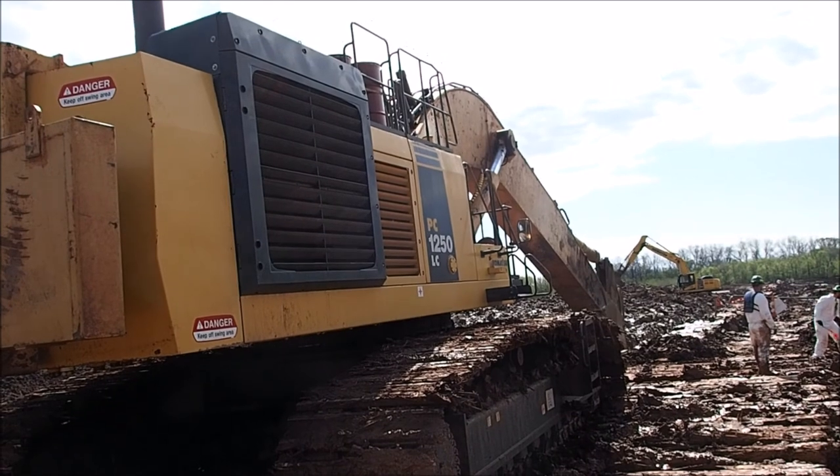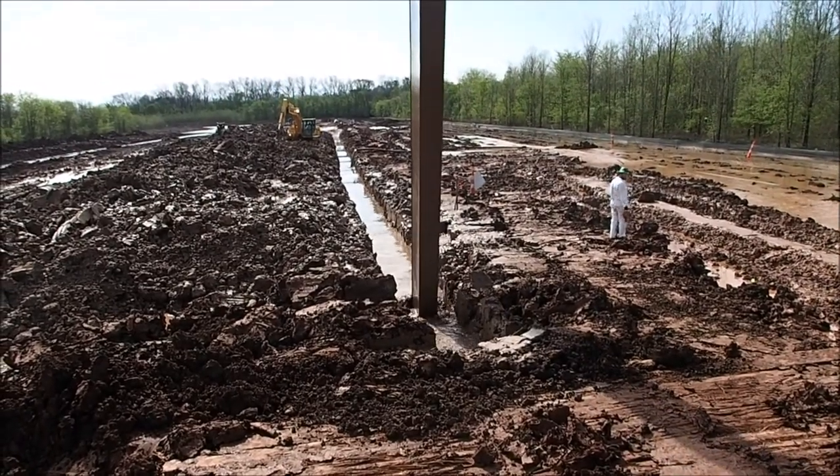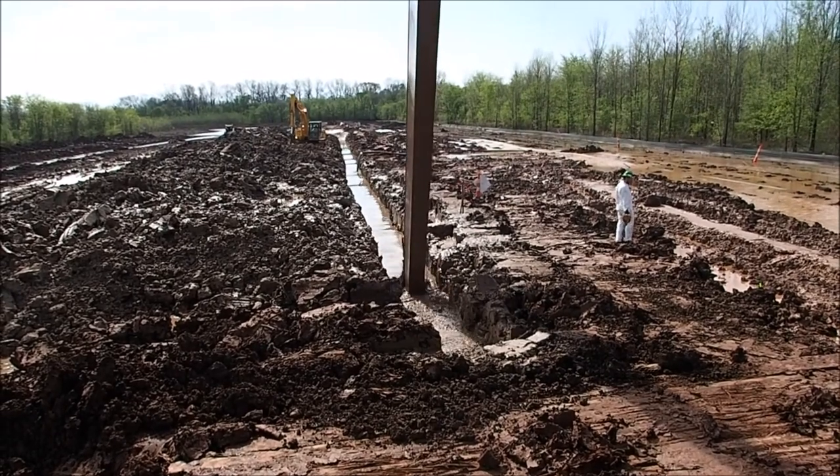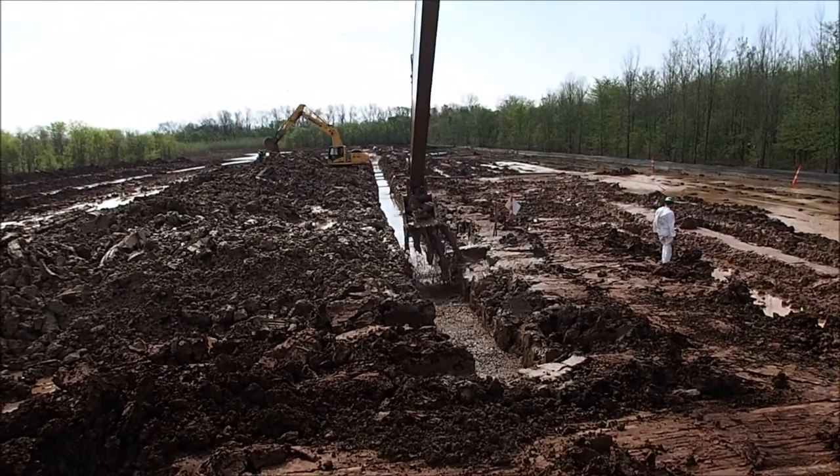You can also, if necessary, park on the bottom of the trench and track backwards, scraping the bottom clean as we introduce the backfill. It's very important to make sure that you have backfill all the way through the trench alignment and no windows of more permeable material.